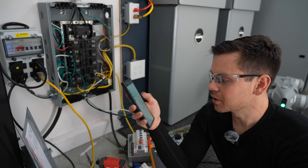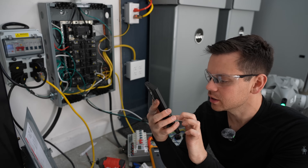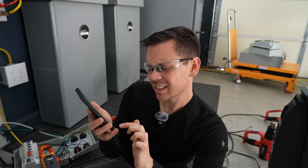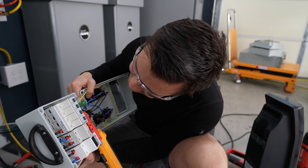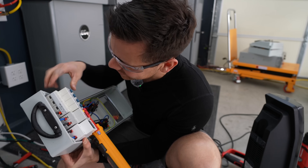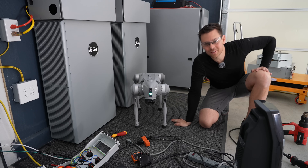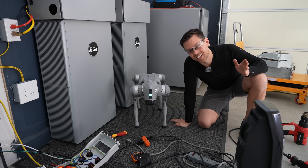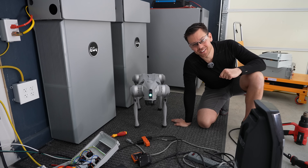The model number is DZ4763. Everything on here looks pretty professional — actually has more information than the home line breaker data sheet, and they have a tripping graph. But as fancy as this site is, I don't see any UL listing. Here we go: certified by National CCC and CE — I can't find that organization or lab anywhere. If it's UL listed, it's going to tell you. For example, this says 'conforms to UL standard,' this says 'UL listed' — all breakers should say UL listed. I don't see it anywhere on here, even on the side. Would you go to sleep with that in your house, Fluffy? I didn't think so — even Fluffy agrees. Use UL listed, high-quality circuit breakers always. These Chinese ones, you never know what you're getting. Thank you so much for watching and I will see you in the next video.